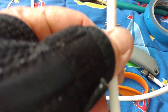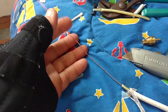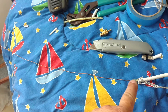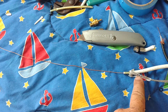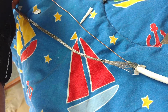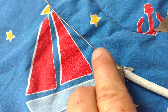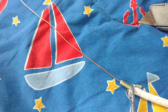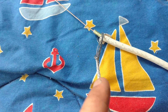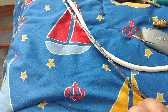First step, I had to take the rubber casing off to expose that long copper wire. I cut a section about a foot and a half long and cut off the insulator for the wire. Then I carefully separated all that shielding material from the coaxial — separate it without breaking it — then peel that back. Then I had to cut off the insulator from the copper wire, so I have the copper wire exposed by itself and the shielding still in place. This becomes the positive of the antenna and this becomes the negative of the antenna. If you stretch it out so the positive goes one way and the negative goes the other way, you have an antenna.